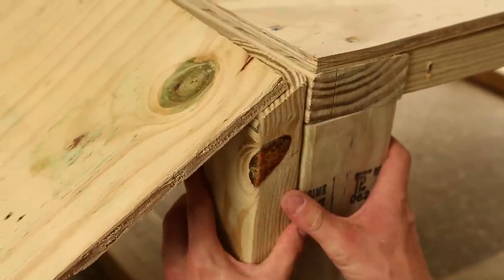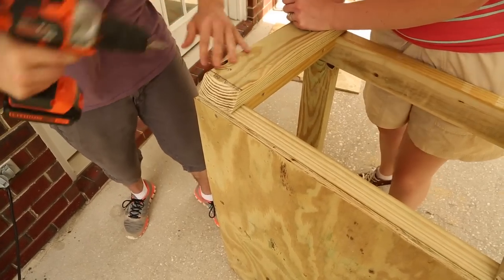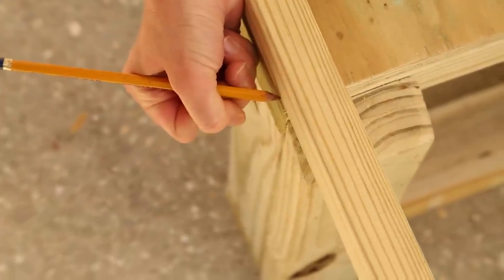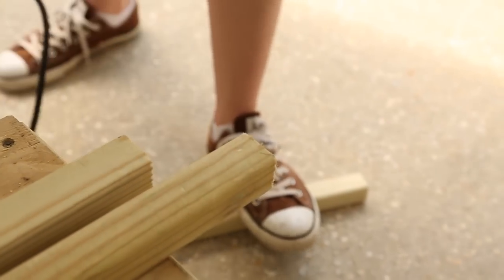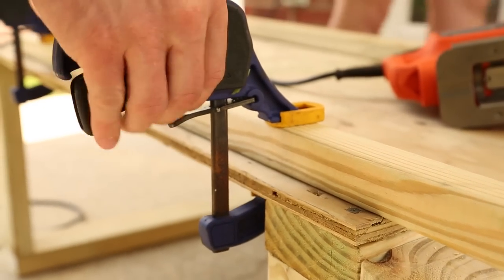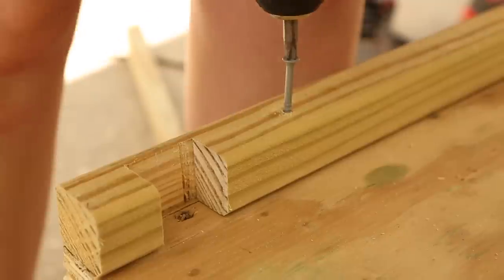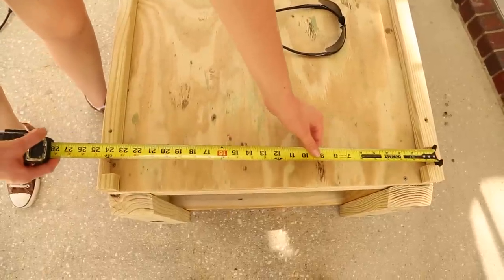These two angled verticals need to be flush at the top with the platform legs before attaching. We're cutting a border to put around the platform to keep the lawn mower in place, using 2x2 material. To get measurements for the two long sides, we simply lay them on top of the plywood and make a mark. We cut a notch into both side pieces, then cut another 2x2 to fit inside. For these precision cuts, we clamp the long side boards down and cut them using a jigsaw. With the notches cut and boards attached, we measure the length of the removable piece and cut it to size.